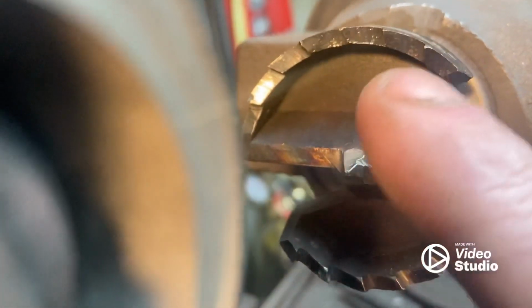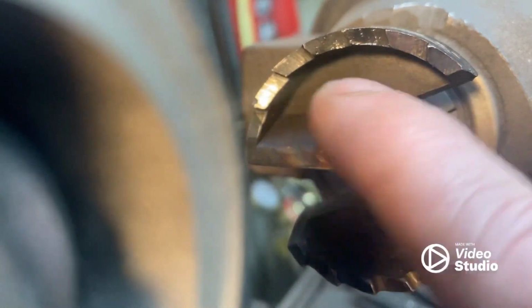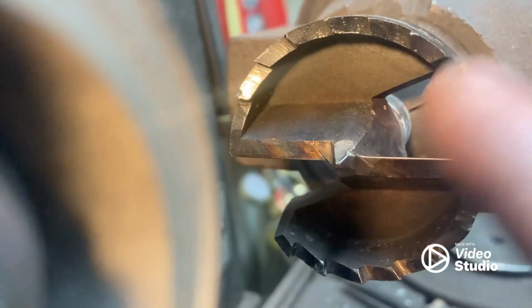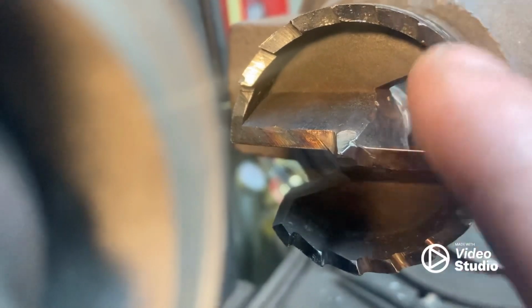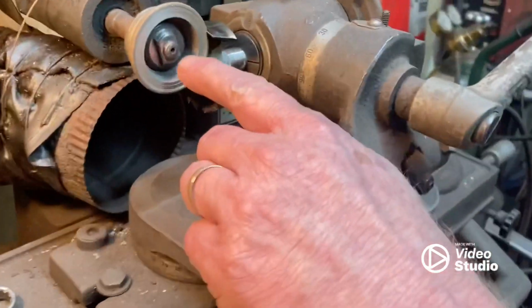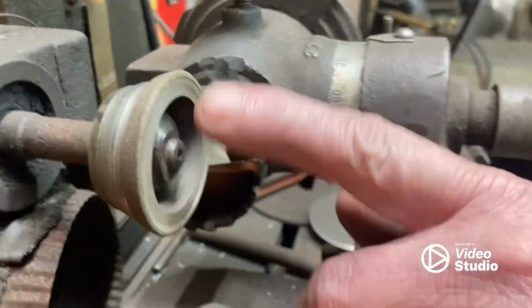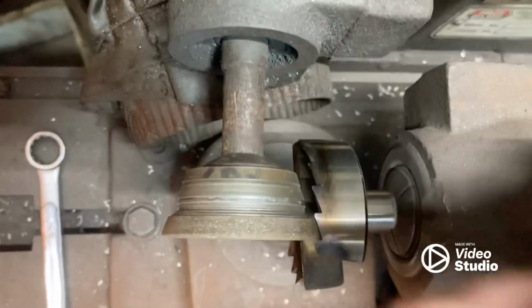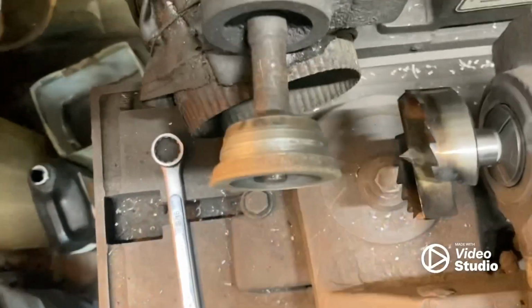Somebody else has already sharpened this thing, but I think you can see right there where it's cocked back. But hey, we're going to show you how to do this. Pay attention, sharpening guys. These are money makers. All right, guys, so we manipulated our center to the center of what we're cutting. So we're getting a 10 degree bevel on the back. Then we've manipulated the wheel out, so we're getting 10 degrees here. So just hang in, here we go.